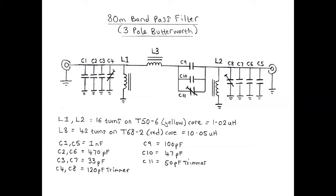Now that's actually really important with bandpass filters. This is where you need your nanoVNA, definitely. That is a godsend for that. You can waste days of your life fiddling around with these little blighters, believe me. So if you've got something that can give you an idea of the shape and where that passband is, like a nanoVNA, it is absolutely superb. So if you've got some variable capacitance on either side, on these bookends, if you like, that controls where your filter lies. So if it's peaking too soon, you can shunt it up or shunt it back by controlling those.